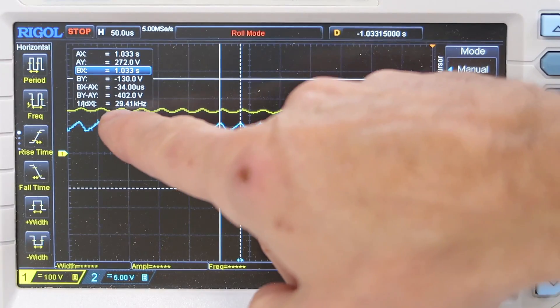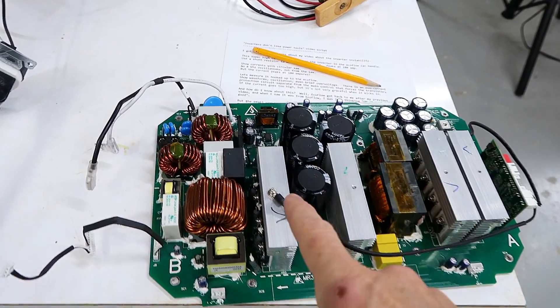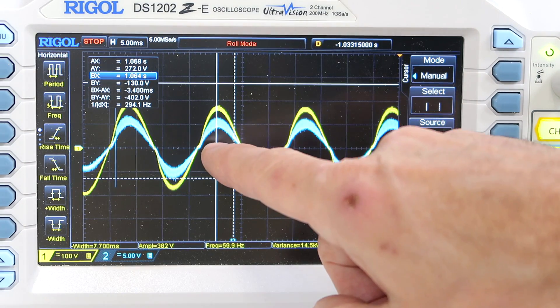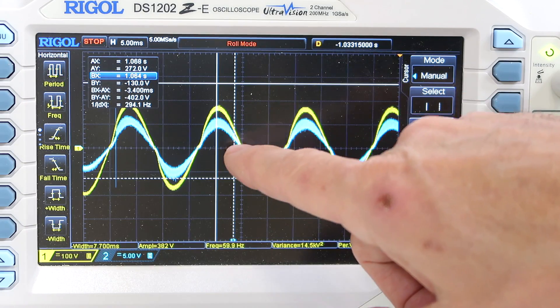Zooming in on one cycle, that's about 30 kilohertz — no doubt the switching frequency of the inverter inside. This is actually the inverter board from one of these. It's like a computer power supply switching at high frequencies. These things always run well above audible frequencies because the transformers do emit a little bit of sound, but if it's high enough frequency nobody can hear it. So when it's way overloaded, some of that does come through and doesn't get filtered out. The current was peaking at about 48 amperes, which works out to about 33 amps RMS, times 120 volts is 4000 watts — way overloading it — and so it's no wonder it called it quits within half a second.